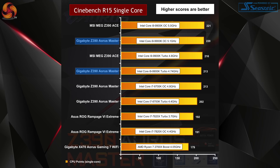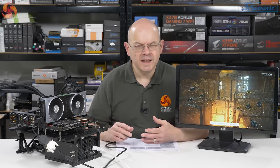If you're paying a premium for VRMs that run at 40-something degrees rather than 60-something degrees, you might wonder if it's worth it — but you don't pay extra for this. This motherboard is comparable with others priced around £300 in terms of features, and the excellent VRMs are simply part of what Gigabyte includes. This is part of Gigabyte restoring their reputation after some shaky work some years ago. This board is very close to the top of their product stack, and it delivers. The only thing I really don't like are those control buttons on the IO panel — the power and clear CMOS buttons.